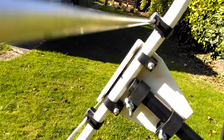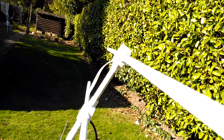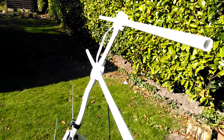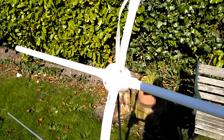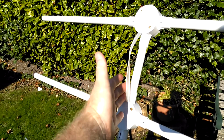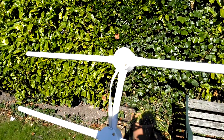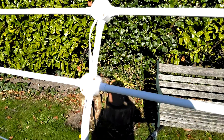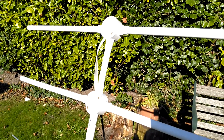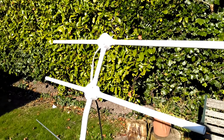The boom itself is 25mm PVC conduit, and the rear elements here are 20mm PVC conduit. There's a three-way box and a four-way box. 300 ohm ribbon is what I've constructed the whole driven part of the antenna from, and that's actually what's inside these tubes here, made into effectively folded dipoles. That's basically how the ZL Special works. The measurements given by FC Judd gave me a flat SWR straight away from the word go — it was right on the money.